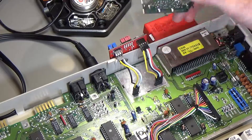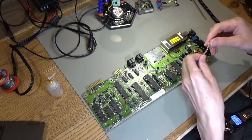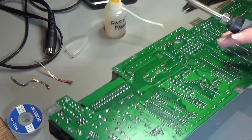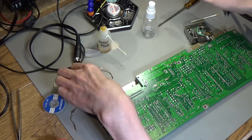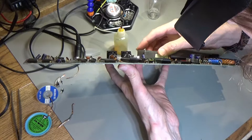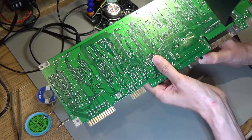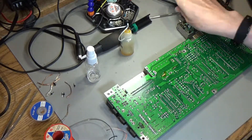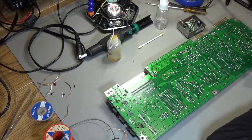I'm going to put this back together and re-install the modulator. First job is to desolder these pin headers using some solder wick because my desoldering station is blocked. There's just too much solder in those holes — getting the pins back in is not easy. There's one massive ground hole I can't clear, so I'm going to have to fix my desoldering pump. At great expense to my mental health, I've managed to unblock it, and we finally got the solder out.